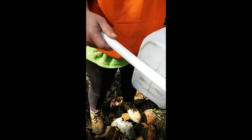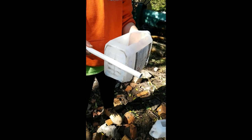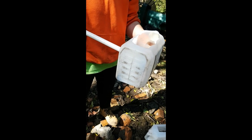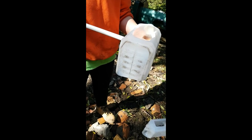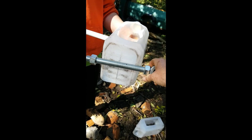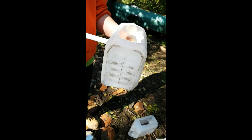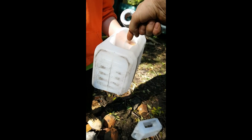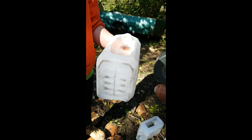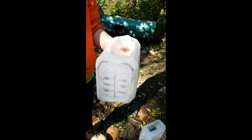We're going to put these, this is just a 21.5 mil wastewater pipe. That's going to go through there and be taped on either side to try and give that box some structure and rigidity, so that this eye bolt can go through and the washers can sit neatly, because I can't think of how else we're going to do that. Into this we're going to poke in four rebars that are going to go all the way through the bottom, which will tie that top piece in with the whole structure, and that's basically it.